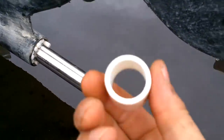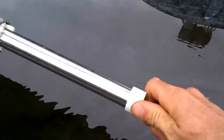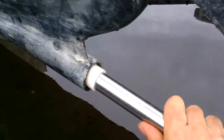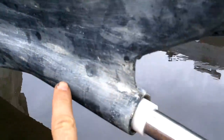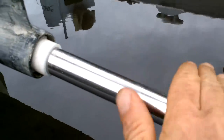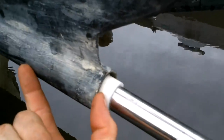Let's get this thing on. It's supposed to be tight. Cool — there's still enough space for water to get through. I'm going to drill a couple holes in here so water can come through, run right through the bearing, and out this way to keep it nice and lubed up. The nice thing about rollers is it spreads the weight along the whole roller length. I probably couldn't get away with plastic bearings if they were balls, because the contact area would be much smaller.